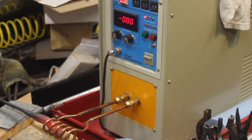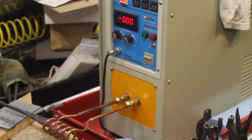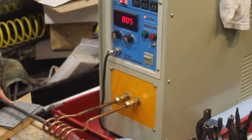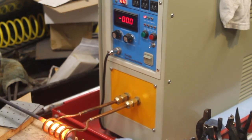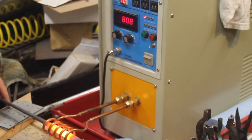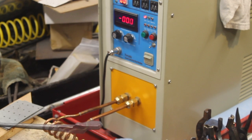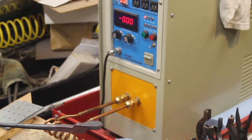As you can see, I used the first heat to rough out the jaw and the boss. Now the jaw is basically as wide as I can get through the coils, and the boss is finished. So I'm going to take the next few heats to work on the transition to the reins. If these were flat bit tongs I'd be done, but I'm going for V-bit here, so I need to work the jaw a bit more. I'm going to see how far I can get with this coil before I have to switch to the one and a half.